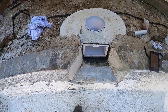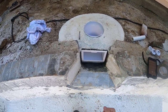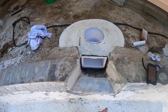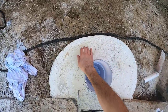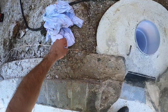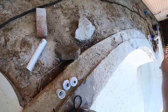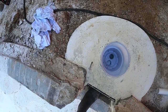As you know we obviously demoed and removed the old skimmers. We got the new skimmers plumbed in, set, and installed. We used a cut Sonotube to form up around the skimmer and then used about 10 bags of 5,000 psi concrete to actually pour and entomb this new skimmer. The pour went really well — we did the rebar cage. You can see I've got my number eight bare copper bonding wire here, connecting all the rebar entombed in the concrete. It comes out the other side, runs down to the other skimmer, and we'll make sure we connect everything and run it back to the equipment pad for proper bonding.